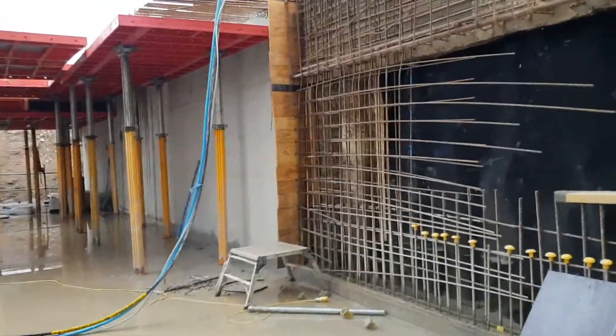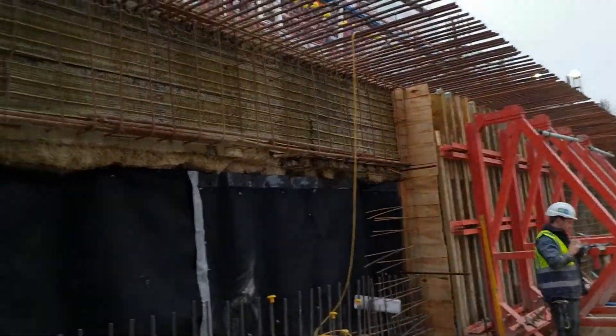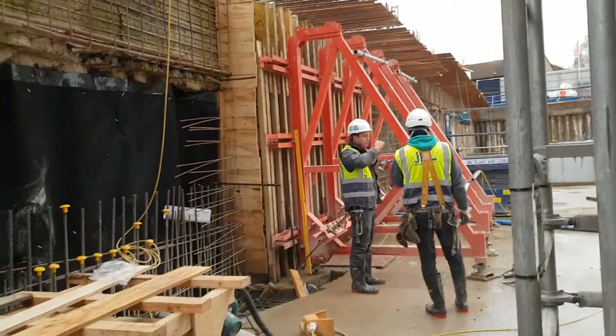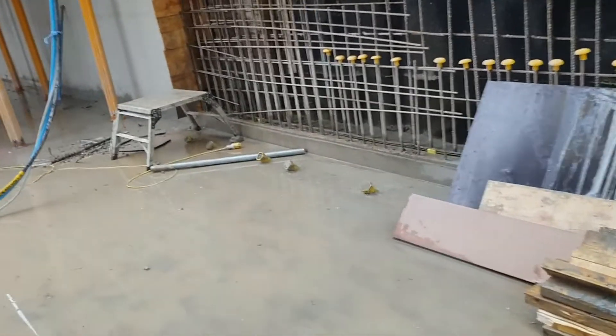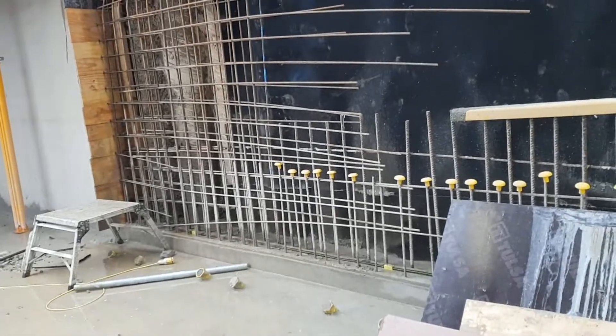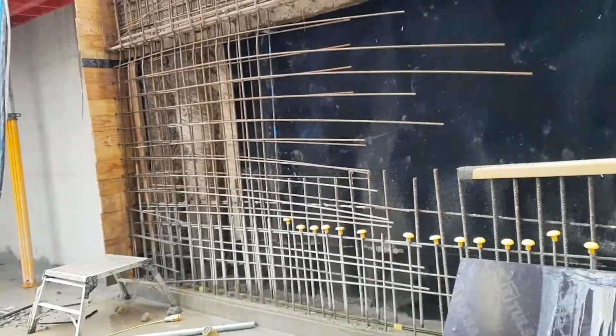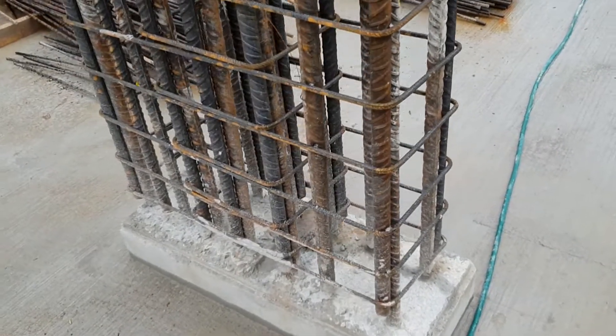Just to show you quickly, the liner wall here is getting ready — the kicker is there. The guy's going to be pouring the next bead, leaving this open for now as you can't really put the shutter in here yet. That's the a-frames — it's a single frame. You see the anchors — I remember stressing myself setting these anchors, but it's not that difficult. Those are the anchors for the single-sided wall. Imagine the pressure from the wall while they're pouring — it's around three and a half metres here.